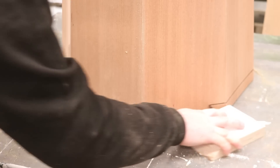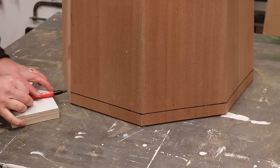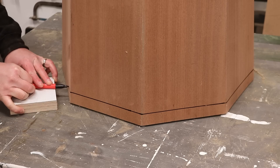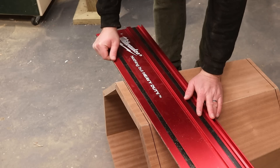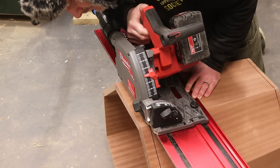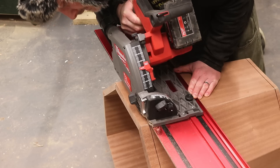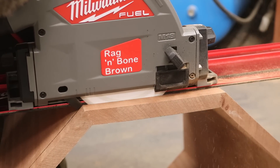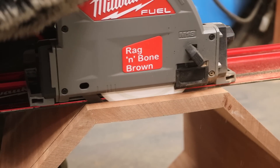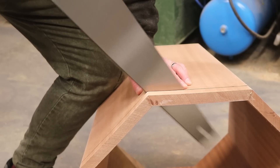With the basket placed upside down on my workbench, I scribe a straight edge referencing from the flat surface of my workbench top, and this is going to be where I make the cuts to get the top edges flat. I set the plunge saw to 10 degrees — that's 5 degrees to match the taper plus another 5 degrees to correct for the mistake made earlier. Then I can work my way around making plunge cuts through each board, but I need to be careful not to cut into the boards next to it as that would throw off the angle. I then needed to come back with a handsaw to finish off the cuts.